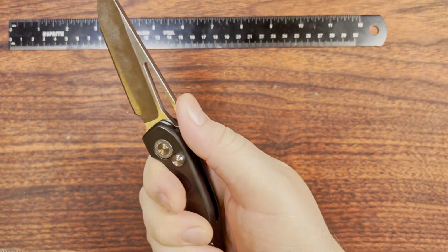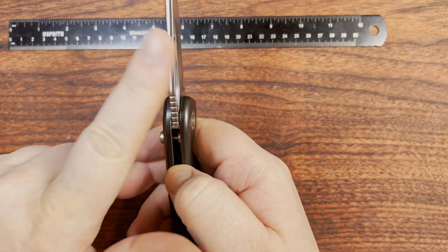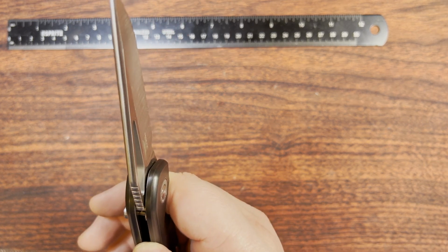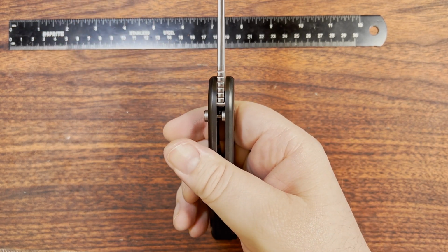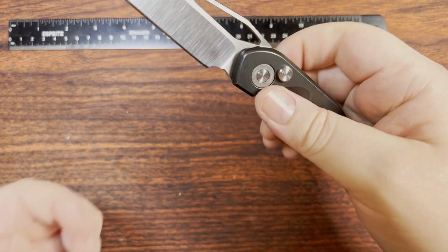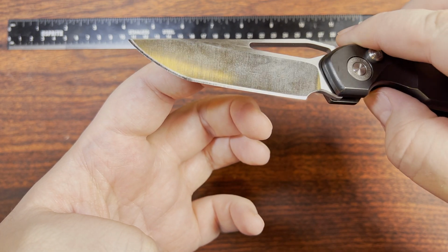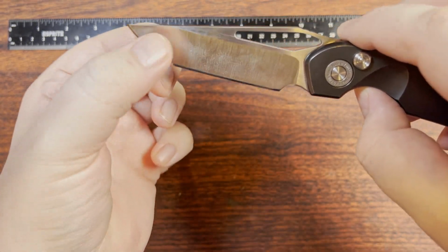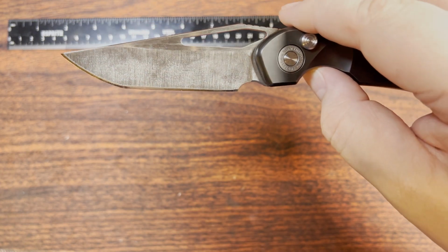This still isn't a light knife by any stretch of the imagination. And I don't remember exactly the blade stock thickness on there. I think they said something like 3.8, but it looks a little bit closer to 4 to my eyes. But still very, very comfortable in the hand. Hollow ground. I just finished ending up doing a reprofile to 17 degrees, and you can see that brought the shoulder up quite a bit on that.